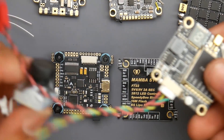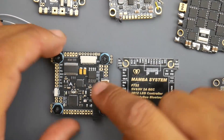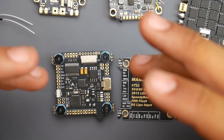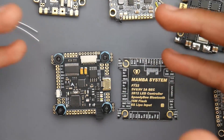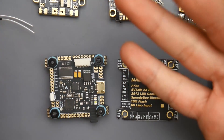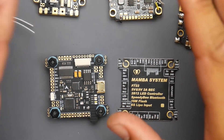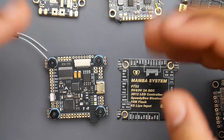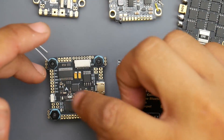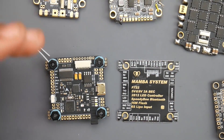You might ask, why can't we connect the video transmitter and the camera together directly? You can. But the reason why people don't do that is because we have this little chip right here that gives us very valuable information on the screen — they call it OSD, which is an on-screen display. It gives you the battery voltage, if you're running out of signal, how long you've been flying. This is why we route the camera and the VTX through the flight controller, so it can pass through that on-screen display chip to give us all that information down to our goggles.